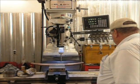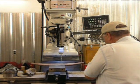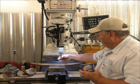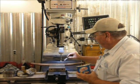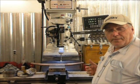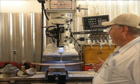Now we'll use some special handy-dandy drilling lube. Basically all it is is a can of Crisco shortening. It's cheap. It's about as oily as you'll find, and it really does work. In my opinion, there's no real need to have high-dollar liquid that is hazardous to breathe. This stuff is about as hazardous as breathing the vapor off of cooking a pan of French fries. So maybe that's hard on you, maybe not.